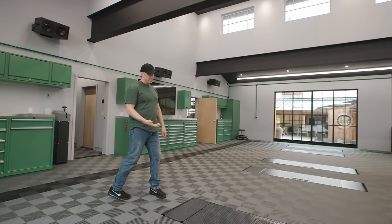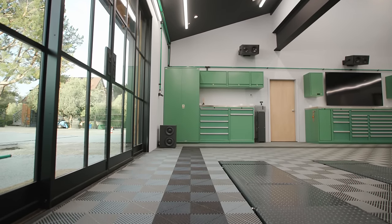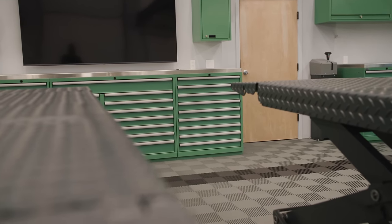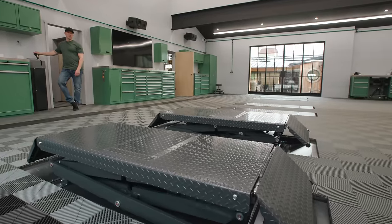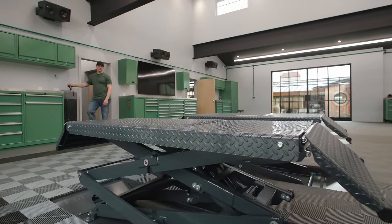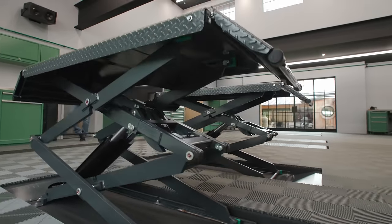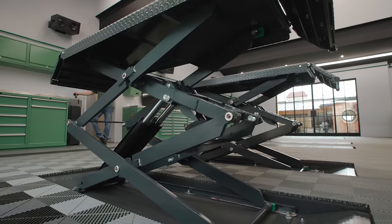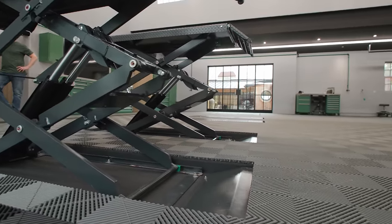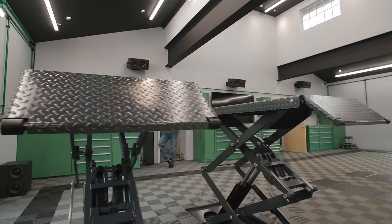When you put a lift in the ground, you lose about four inches of height — so instead of 78 inches, you get about 74 inches plus whatever the lift block provides. This is the 7,000-pound capacity version. Kyle spent a full day painting the wells flat black. The lift itself is in its standard Nussbaum grey finish.